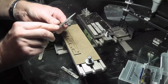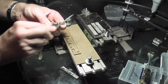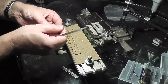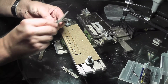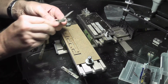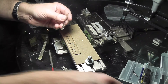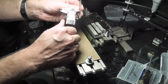Very quick dress over and deburr — it was just hanging on a tiny bit under that front edge, which is my carelessness. What I'm really interested in — what will tell the tale — is the holes for the wheel bearings, which I need to be 3.75 millimeters, because it's the wheel bearings and coupling rods that matter.